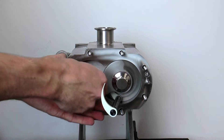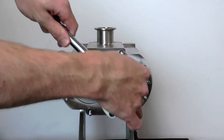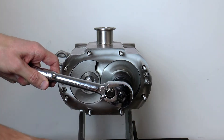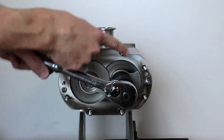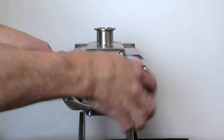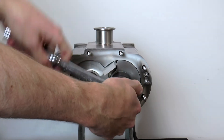When the left-hand screw nut is loose, remove it by hand. Next, switch the wrench to the right-hand screw nut and turn counterclockwise to release the assembly tool. Turn the right-hand screw until the end of the thread lines up with the top. Insert a food-grade blocker in the gap between the right-hand screw thread and the outside diameter of the left-hand screw. This will block the screws from turning.